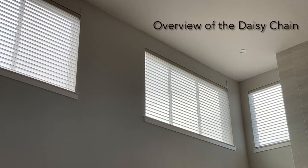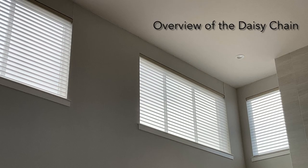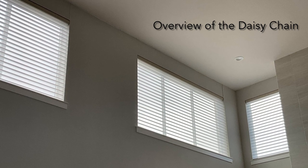This was in process — that cord on the left is just hanging there, I hadn't attached it yet. But this is the overall look. Here's what Hunter Douglas shows as they do it: you've got your power unit on the far right side, an extension cable that goes up to the Y-adapter that allows you to daisy chain. One side of the Y goes to a shade, the other side goes to the next Y-adapter.